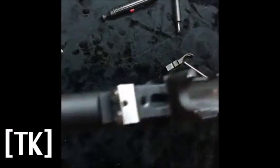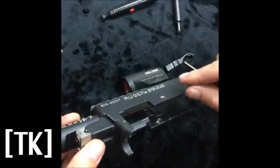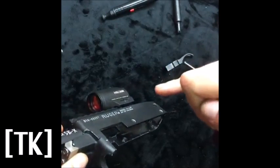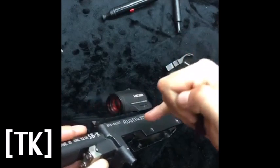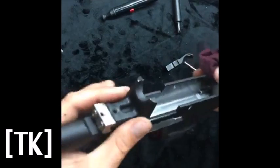When we do that, it's one thing I won't do because the risk of damaging it is high. Also, a qualified gunsmith's a good idea, but like I said, I just destroy the LCI and rip it out of there, and then notch the pin inside of that cutout, being careful not to hit the receiver, and then stick a screwdriver in there and pop it out.